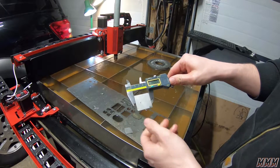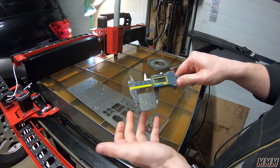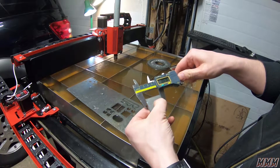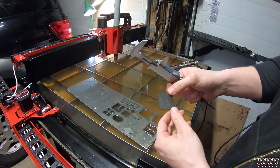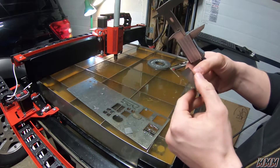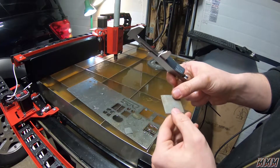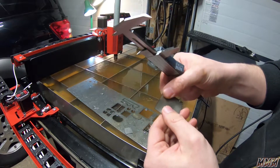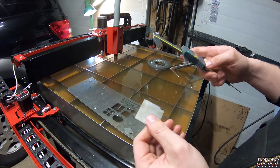This one is an inch and a half, I think. It's measuring 0.014 off — 14, 15 thousandths. That's pretty close, so I just need to play with my kerf settings to get that dead on. Still a little lead-in mark there, but when I look at the bottom there is hardly any slag at all — hardly any cleanup needed. I just need to get my lead-ins right. That's pretty awesome.